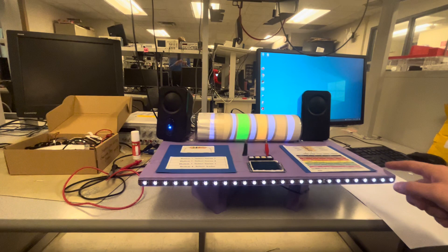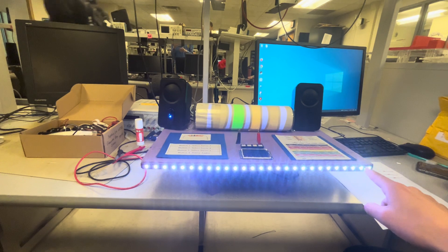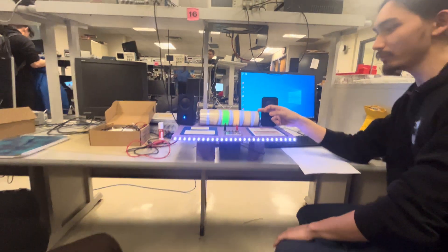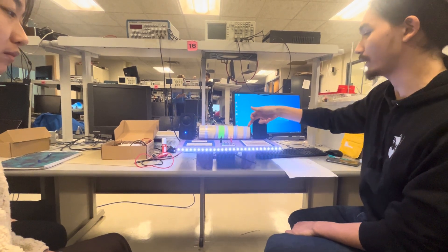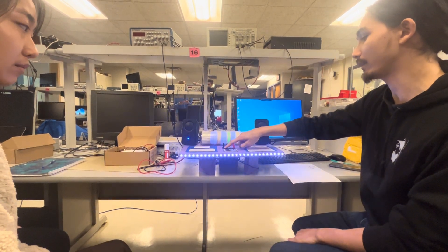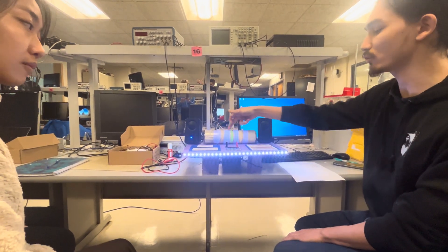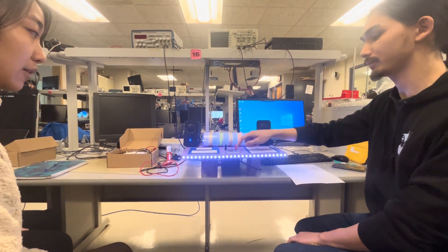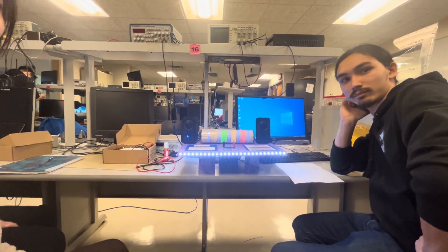Is this an RGB LED strip? Yes. Is it the same strip that forms the decorative band and also goes inside the lamp? Correct. Inside there are 15 LEDs, and we assigned each LED from 0 to 14 to a certain position. When you select three-band mode, certain LEDs get the actual colors and the others are background to frame that color — same for four-band and five-band. So physically, the LEDs in the lamp and the LEDs for decor are on the same strip but logically separate.